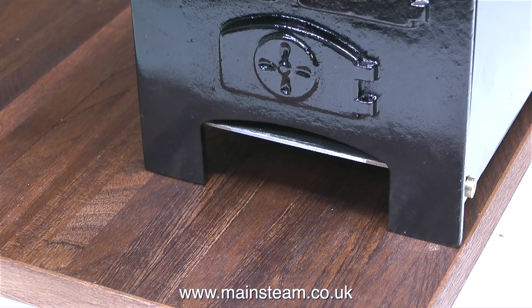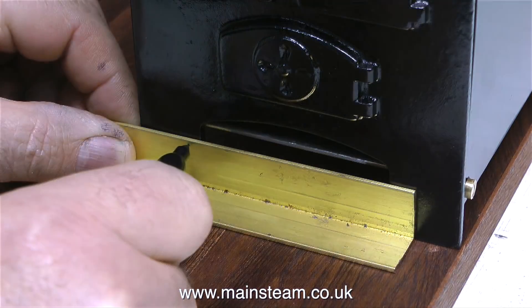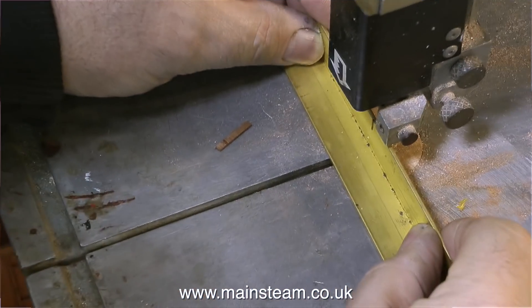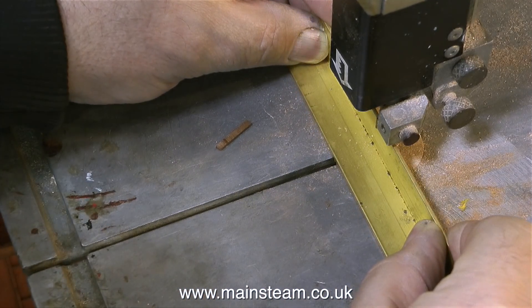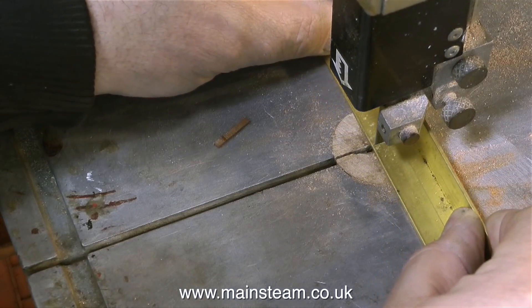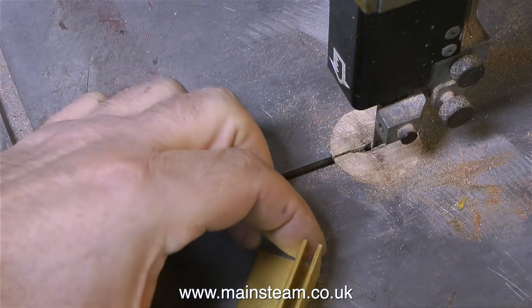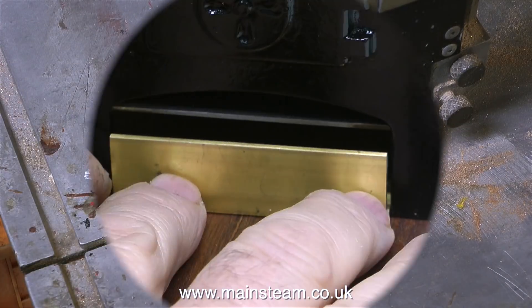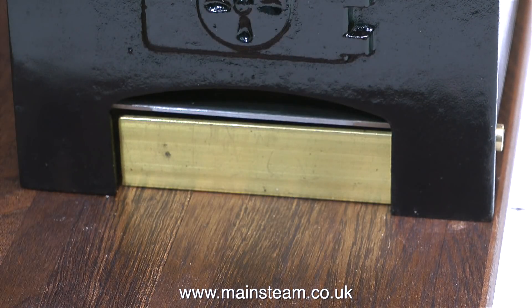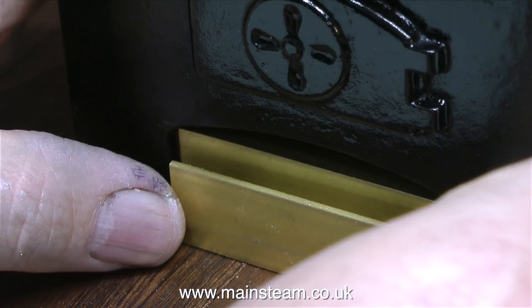Some of these 504 boilers — I think the later models — had mounting lugs cast in, and I've seen a few instances when these mounting lugs have been broken off, because the cast iron endplates are quite brittle. I initially thought about using two pieces of brass angle bolted together, and here I am on my small bandsaw cutting a piece of brass angle to make two pieces to do the job. This mounting method only works if you have the heat shield in place. I made a heat shield in a previous episode, so if you want to cross-reference it, you'll have to go back and look at some of the other episodes.